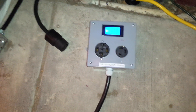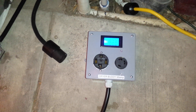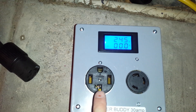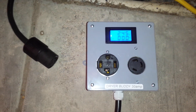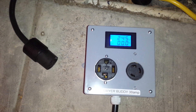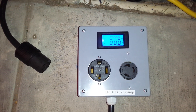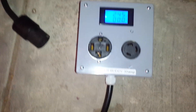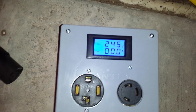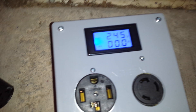This is a video of my new dryer buddy. It's basically a 30 amp splitter with a meter. It uses a plug the same style as a NEMA 14-30 outlet — common for dryers in houses built 1996 and up. Before that, they used a NEMA 10-30. It also has an L6-30 twist lock outlet and an amp meter to read the total draw on the circuit.